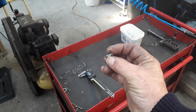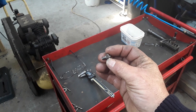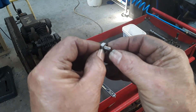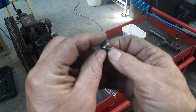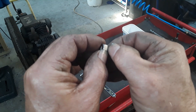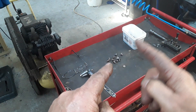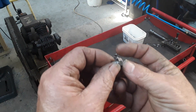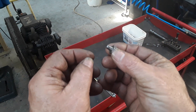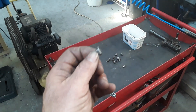I'll put that on a wire buff and just knock that little bit off the back. So that is what we end up with after it's buffed — you can see there's no burrs on the edge and the thread's all nice and clean. Once I machine all these up, I'll just go through and wire buff them all and that'll be fine. But anyway, we've got nice new crankcase drain plugs, and that's how we do it. Hope you've enjoyed it — subscribe and do all that sort of stuff, it helps out.